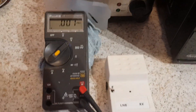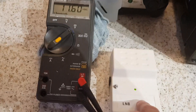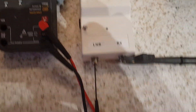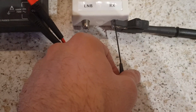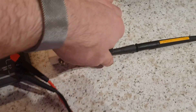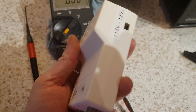Here's a video of it in operation. No output, no power — the power switch is off. If I turn that on, it's in 12 volt regulated mode. Flick the switch on the side and it goes to 18 volts. If I go into the receive port, there's nothing coming out as expected — no power going back to the receiver. Also, the DC jack is wired so that as soon as you plug it in, it disconnects the batteries.